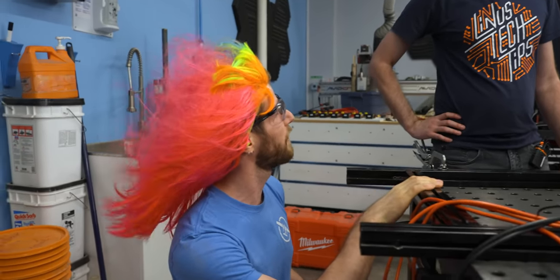Okay, we ready? Okay, that's 5 amps. Yeah. Can we do 20x this? Yes. Okay, that's 7 amps. We're already down, not thermal throttling anymore. Let's try to get to 10. Wow, she's real touchy. Okay, we're at 96 degrees. Temps are going down. You guys want to go to 20 amps?